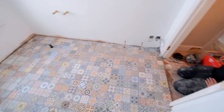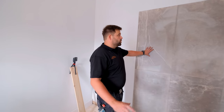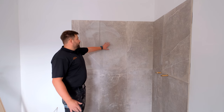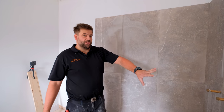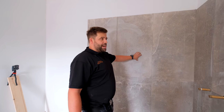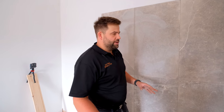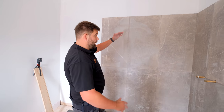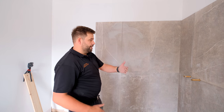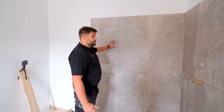So then guys, everything's finished in the bathrooms. So this is the master ensuite. This is all Dan's grouted up. Just got to give it a quick final wash, just waiting for it to all dry up properly. These are the 1200 by 600 we started off with. This is a slightly darker vein tile. We've used silver grey grouting into this. I like to use MAPEI, as you've probably seen in previous videos. Quite straightforward really. It's just two full tiles up, cut into the corner, so it looks like it wraps around. And that's it really, it's quite straightforward. So this is silver grey into this one.